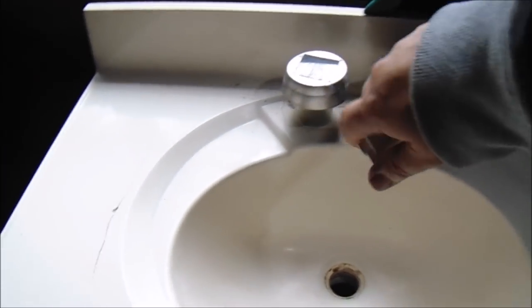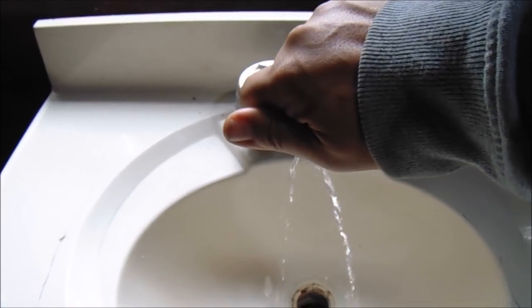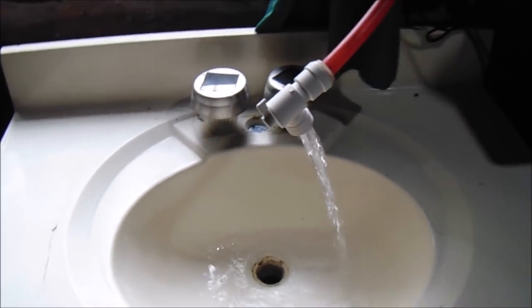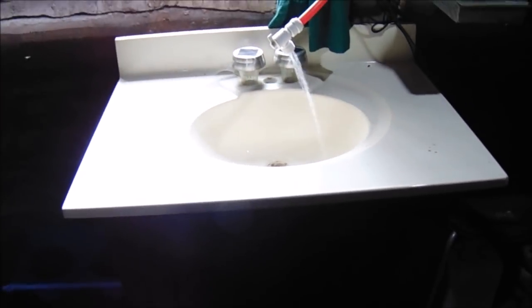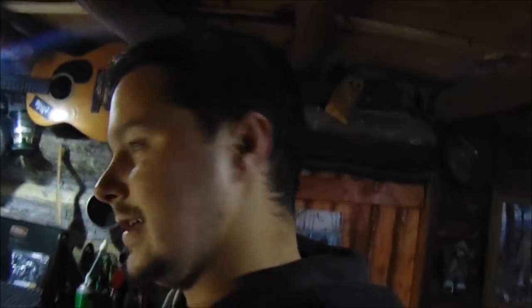The line runs out to the back. This right here is just a simple setup with a shark bite connector. Let's see if I can do this one-handed — I just twist this. There we go. Voila, we have a sink! In the meantime, I don't have a side on this yet. This is a pretty simple method — it just drains into a bucket. Eventually I do plan on running a PEX line out of the bucket through the wall for drainage, but for now I just pull the bucket out when I'm done. Simple as can be.